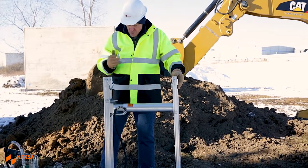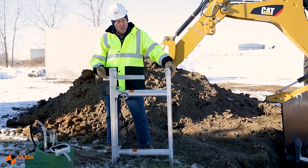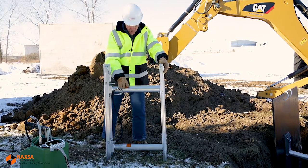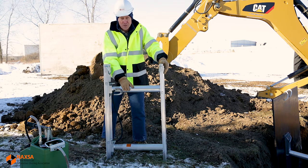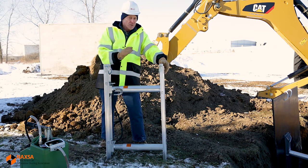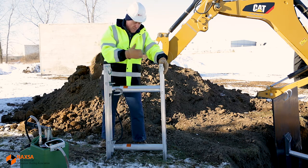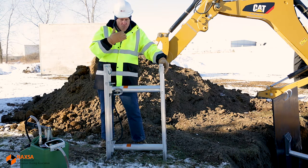This particular shore has a three and a half foot rail. You'll see shores with rails as short as a foot or a foot and a half, or as long as 12 or 15 feet. This shore has two cylinders with a stroke of 22 to 36 inches. Sometimes you'll see one cylinder, sometimes three or four, and the strokes also vary. The length of the rail and the stroke of the cylinder will be determined by the depth and width of the trench.